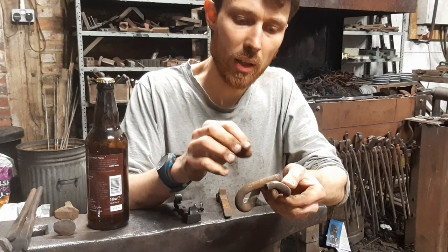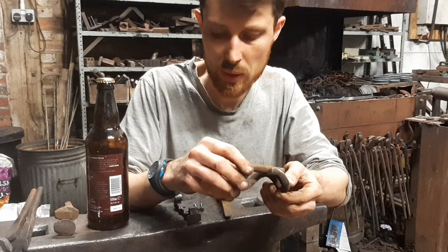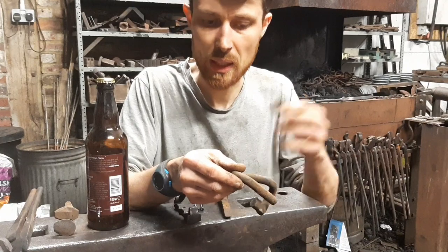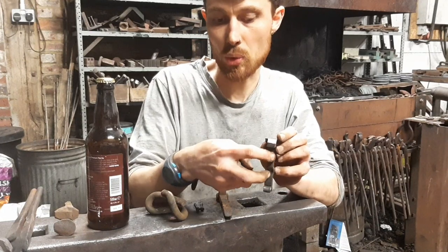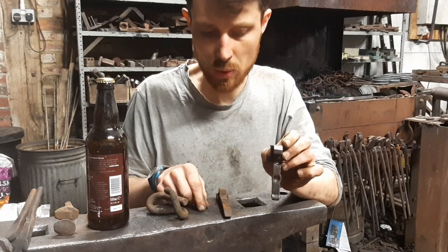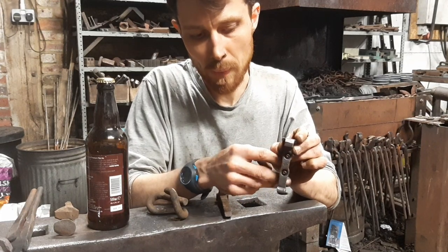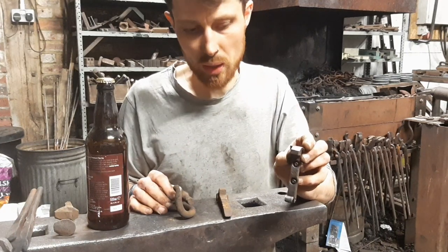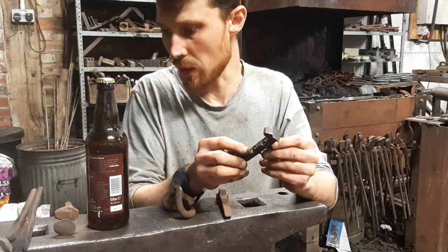The clips are a hard type of steel that's tougher than normal mild steel, so that's why I've partially salvaged one of these into the tool, because over the course of time punching or squashing these dimples in, I do finally drill the holes, but squashing these dimples in to allow for the screws, by salvaging one of these, the tool will last longer and not deform in the same way it would if I was to use just regular mild steel.